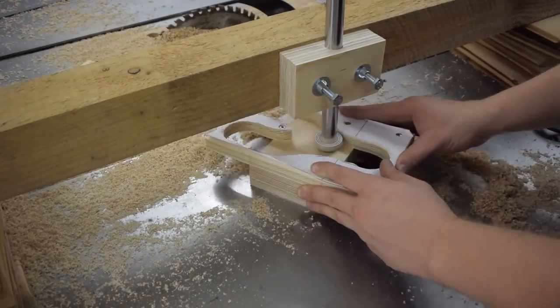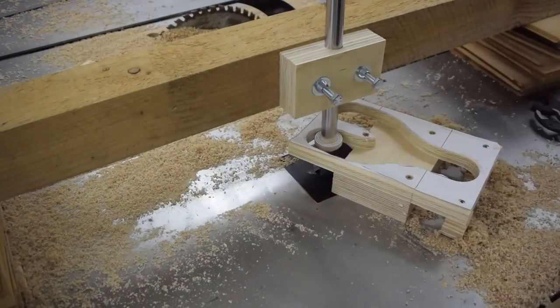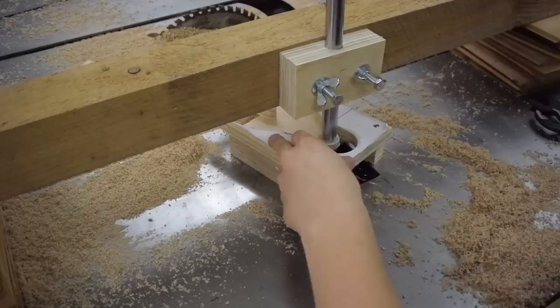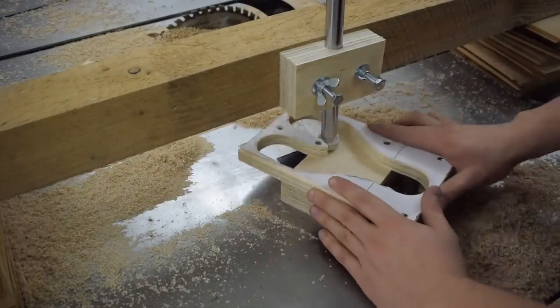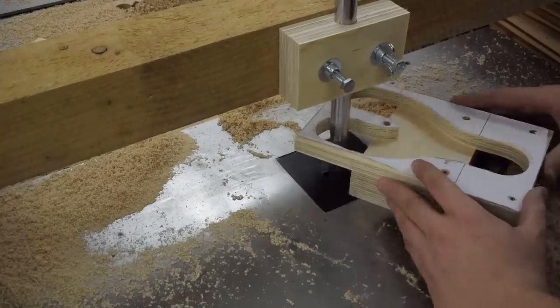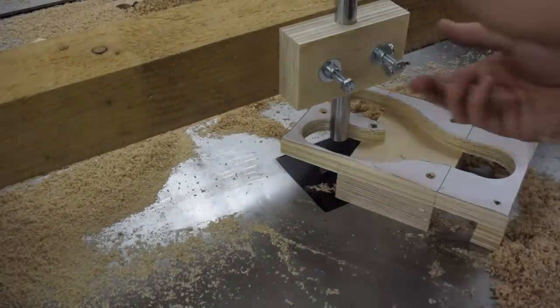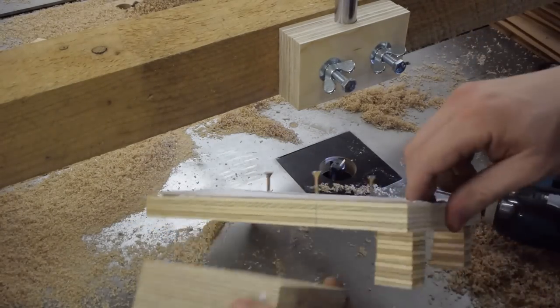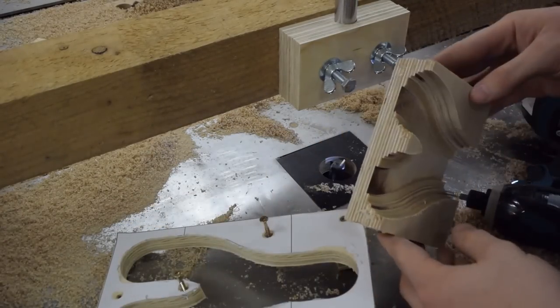The smaller the disc, the wider will be the trench that the router bit cuts. And because I lower the router bit each time, this creates a step pattern. I coordinated this in a way that it will approximate kind of a half circle-ish profile.